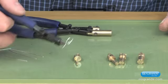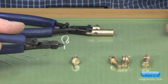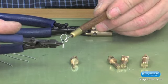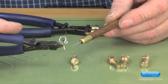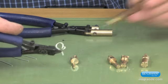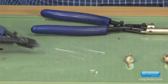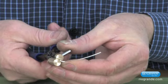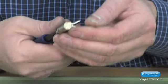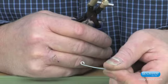I'm going to now make just a small ear wire. It looks like that. The large diameter is nine and a half millimeter and the small diameter is two and a half millimeter. I'll start by cutting my wires two inches long. I'm going to form the small eye first — just put some pressure on the tool and then rotate the tool. I'll let up a little bit and then rotate the tool again, and that gives you the small eye.